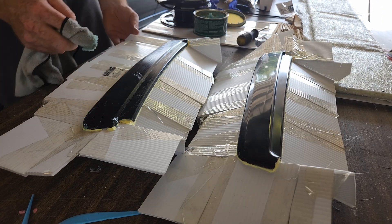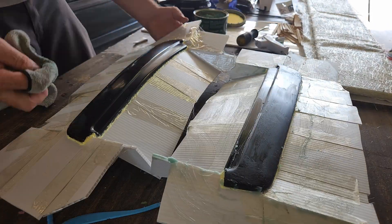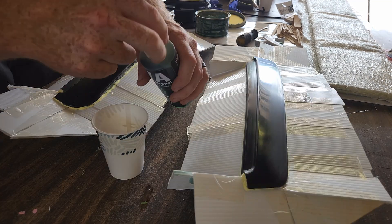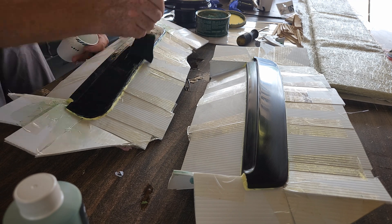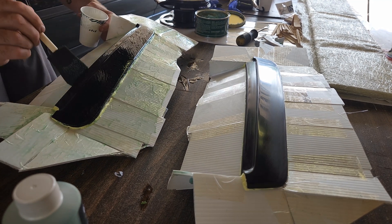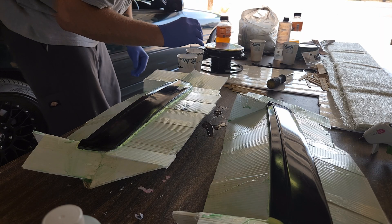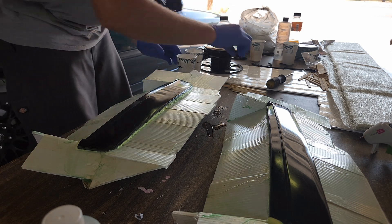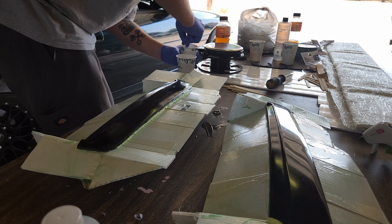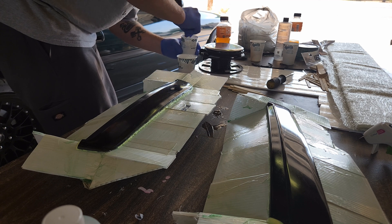After that I gave it a good coating of Part-All Number Two mold release wax. You want to apply it pretty thick and then come back after it dries and wipe it off — kind of like a wax-on wax-off deal. Next I applied the PVA mold release; you want to be pretty generous with this stuff but not so generous that it's runny. After the PVA dries you can go ahead and catalyze your gel coat and get to applying it. For both molds I used a quarter pint of gel coat, and depending on your working conditions you're going to want to catalyze it anywhere from one and a half to two percent.